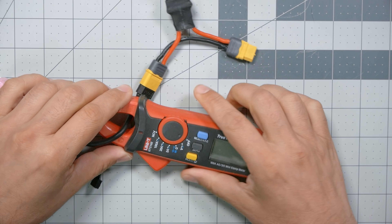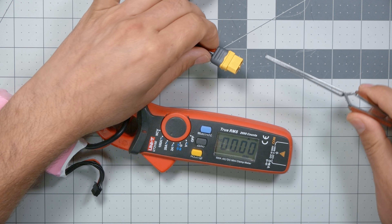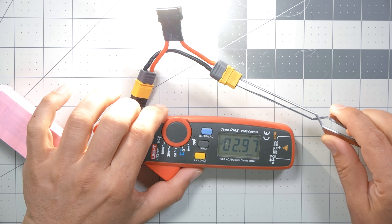This light bulb works as a smokestopper because it has a resistive element on the inside. That resistive element also restricts current flow. Using a clamp meter to measure current in DC mode, when I short-circuit the prongs, the light bulb lights up and we have about 3 amps flowing. Three amps is certainly not nothing, but oftentimes that will not be enough to smoke your flight controller or ESC. It limits the current to a safe level, and the light bulb is a convenient indicator that something ain't right.